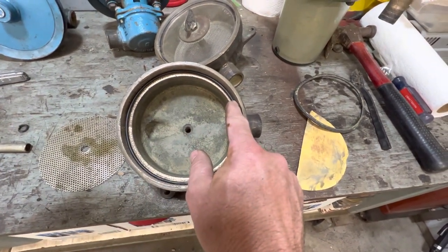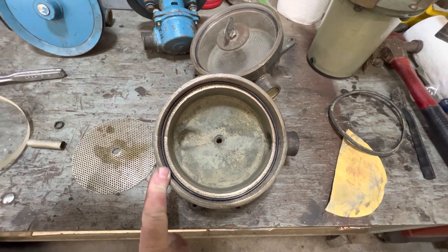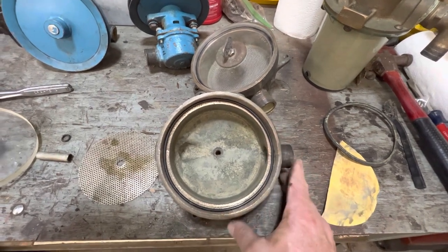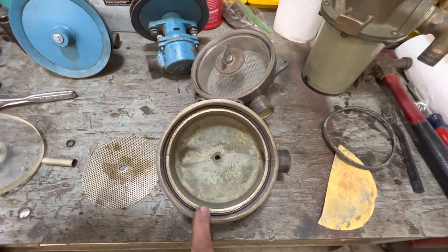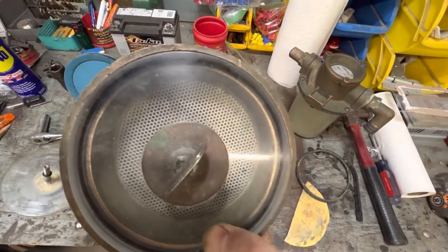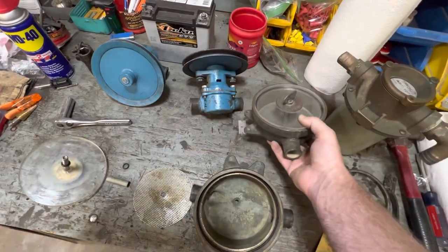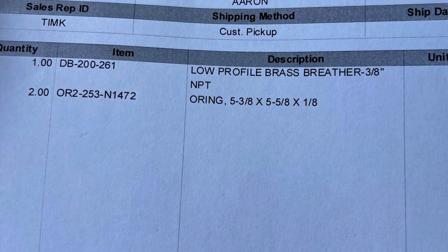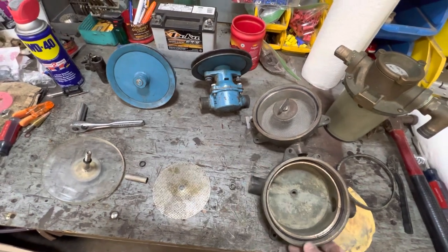It's an eighth inch in diameter, five and three-eighths inches inside-to-inside, and five and five-eighths inches outside-to-outside. I'll put a picture of the actual size right after this. I took it to a local hydraulic cylinder rebuilding facility and said, 'Hey, you got an O-ring to fit this?' They measured it and said yes. I've already done one and it fits really nice and tight, compresses great all the way around. These are about three bucks a piece — six bucks for both strainers.